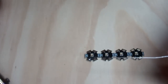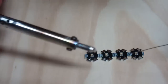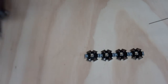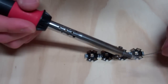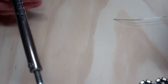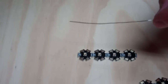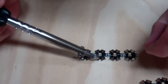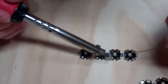Notice I'm using about that much solder — about half that much each time. If I've got a little built up on the iron, I just give it a little thwap with my wrist and the excess solder splats on the floor, sometimes on your foot, which is why you wear shoes. So anyway, pre-tinning LEDs — always a good idea. Keeps the heat from transferring.